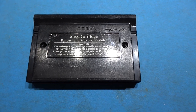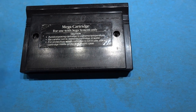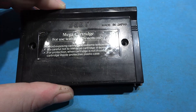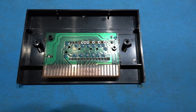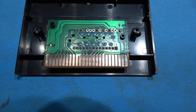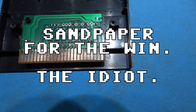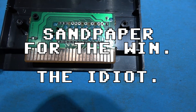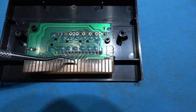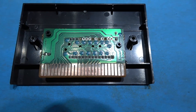I have the back off the cartridge — it's just two game bit screws that you need to open. What I'm going to do now is whip the back off and there you see it. Sorry for laughing because I know what's coming. What the f*** is that? If you look, you can see it looks like someone's gone to war with sandpaper on this thing. It looks like the contacts were originally gold plated but they've gone right the way through to the copper, which is never a good idea because now those copper contacts are going to tarnish.